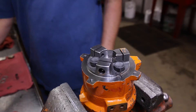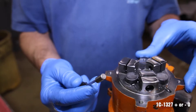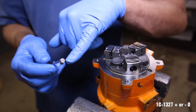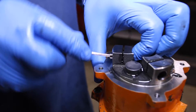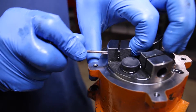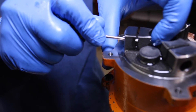Step 3 is the RAM fitting. Start by placing a bit of oil in the bearing. Take a RAM 1C-1327 plus or minus 0 and insert into the port. The RAM needs to have some tolerance, but not too loose or too tight. This one appears to be a good fit, but just to be certain, the technician increases the RAM to a plus 3.